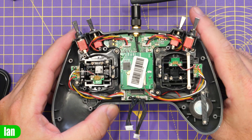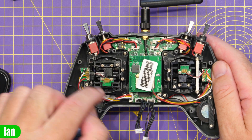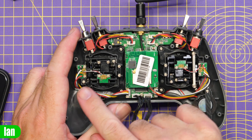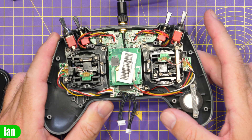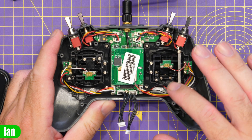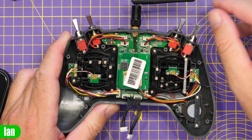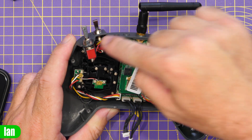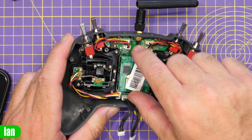You can then see on either side the gimbals with the Hall Effect sensor on each side. You can now easily see the adjustments available: spring tension adjustments for each stick, a slider adjustment, and a bar for adding more tension on the throttle. As mentioned, none of these are accessible from the back of the radio - you do have to lift the cover off. We can also see the switches placed in plastic, which looks quite nice, and the USB-C port. Overall everything looks nice and tidy, with the speaker down there and the main board underneath with the ExpressLRS module.